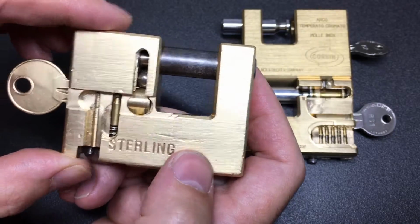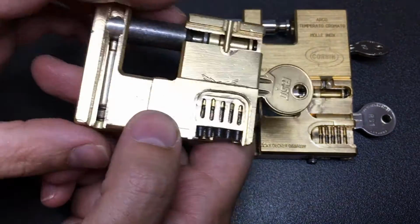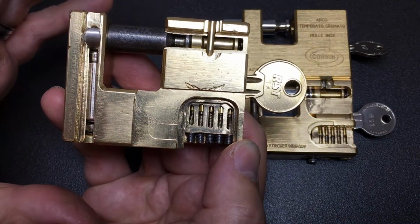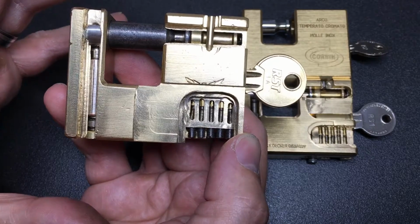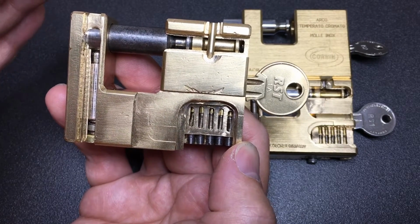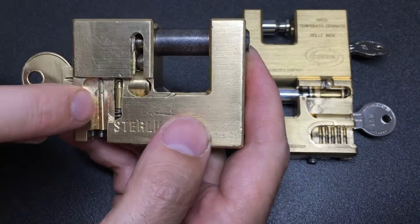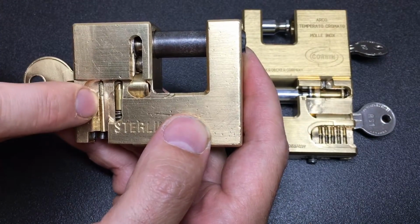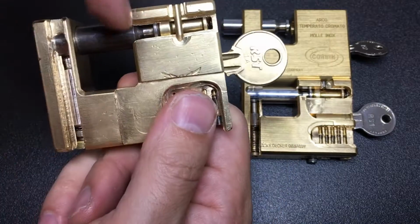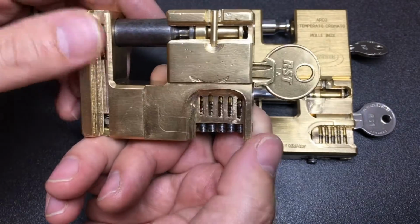Just brilliant work. So yeah, everything about the design of these is so familiar to a standard padlock configuration, but there have also been some real considerations for lock manufacturers to work out so that you can still retain spring tension on the core, that the core doesn't rotate too far, that you can release the shackle or bolt, but actually retain it at the same time.